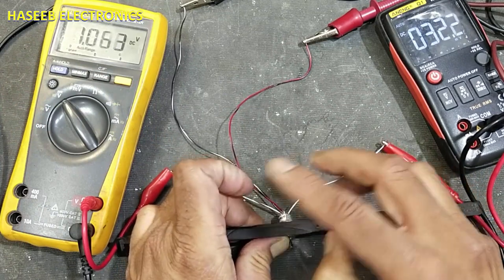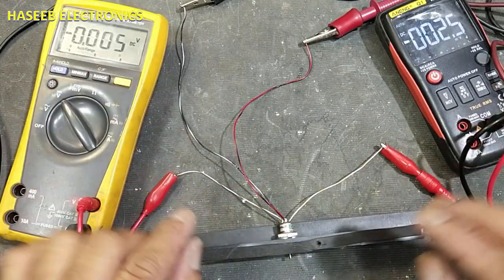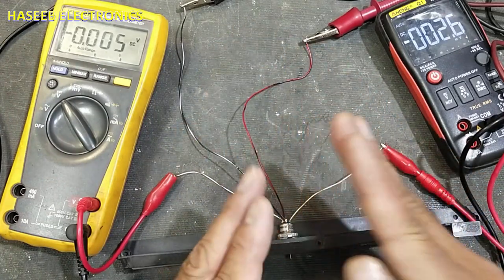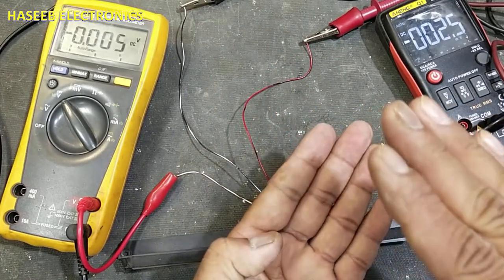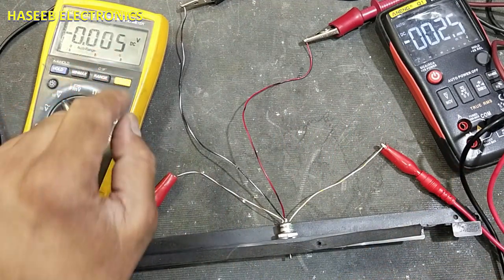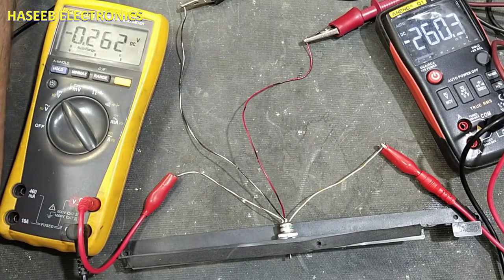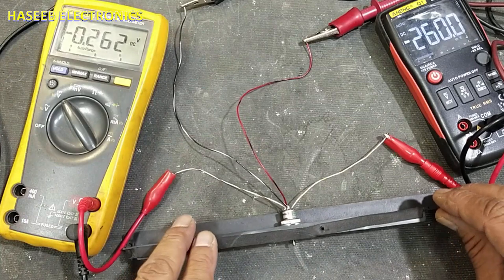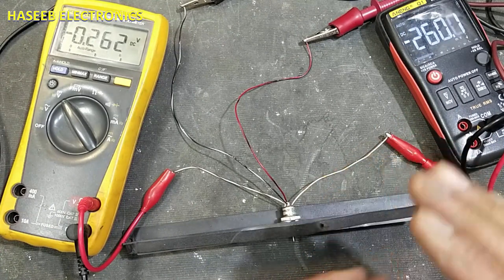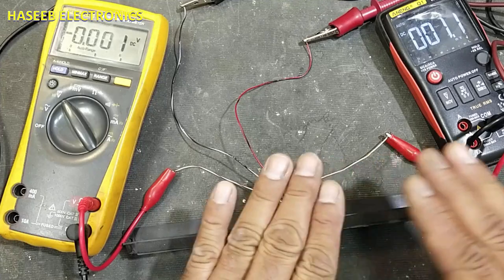On the X-axis, this pin will provide negative voltage when moved left, and positive voltage when moved right. If the voltages are offset from zero at rest, we must verify that both supply voltages here are equal. If one power supply is high and the other is low, it will create an offset. For example, increasing the negative supply gives about 0.262 volt — a 260 millivolt offset in the downside direction.